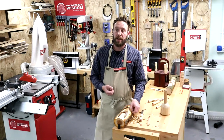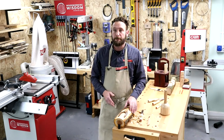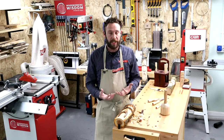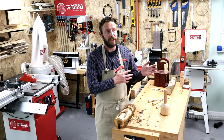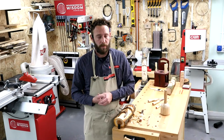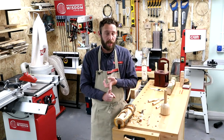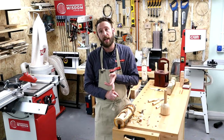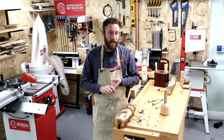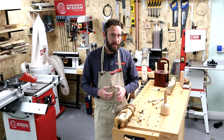Don't give yourself too much of a challenge, because quite often when I first tried carving, I found it really difficult to get out of my head what I wanted in 3D in front of me. Quite frustrating. It put me off for ages, and only in the last couple of years I've come back into it and am getting a little bit more confident. But it can put you off things if you're using the wrong type of timbers. So we want sharp chisels, and we want suitable timbers. And there's lists online, but certainly things like lime and sycamore, the fruit woods, the basswood, they call lime out in America. See if you can get hold of those things and make it easy for yourself.